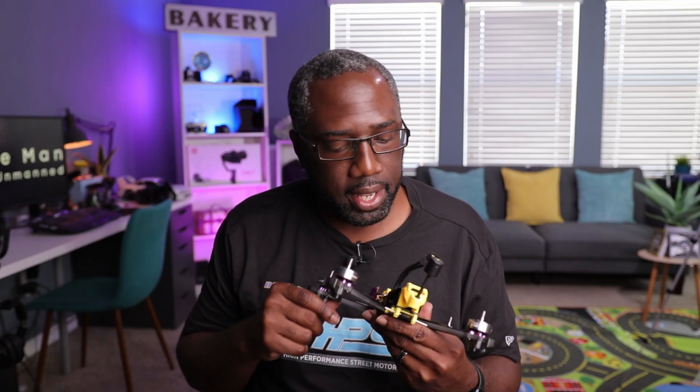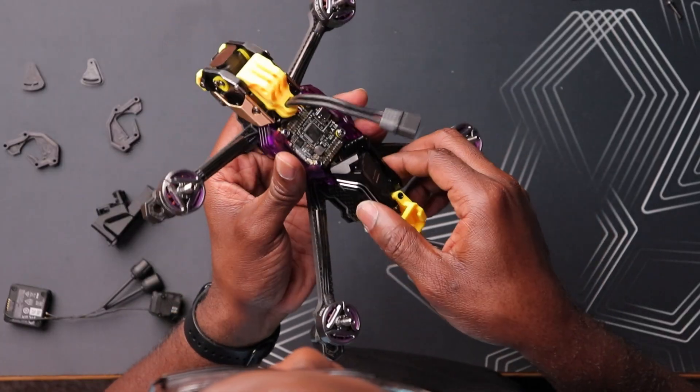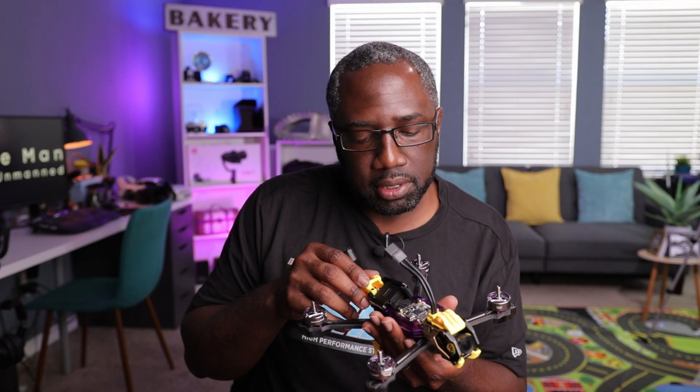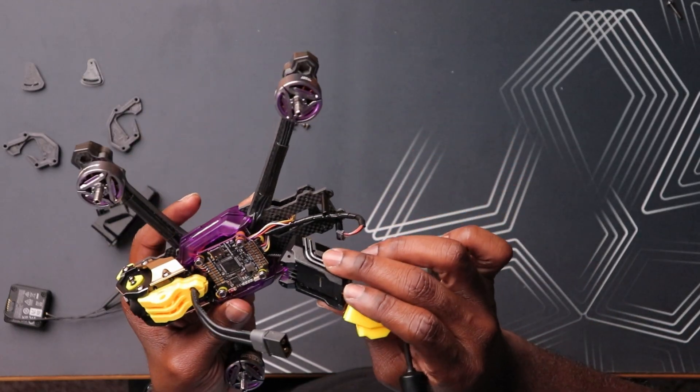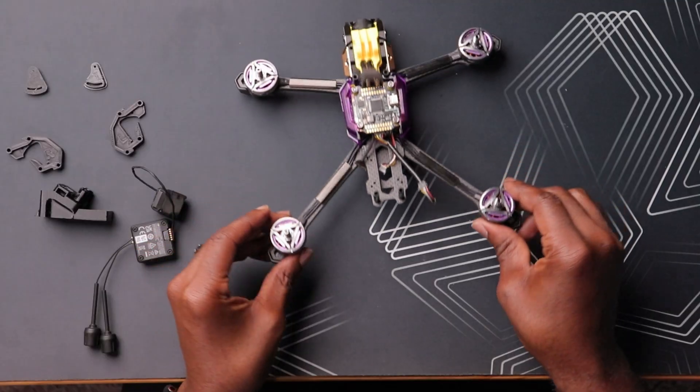It's not compatible for O4, so I think that heat sink is all going to be gone. The heat sink is actually mounted directly to the air unit — that's why it couldn't come out. I guess we'll be using regular standoffs in this one. The DJI O3 has the same plug as the O4, so I'm just going to unplug that. The only thing holding this thing in place right now is the MIPI cable. I'm going to pry it off. VTX is free — the O3 is out.